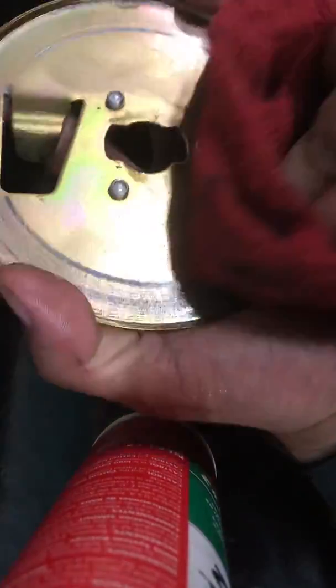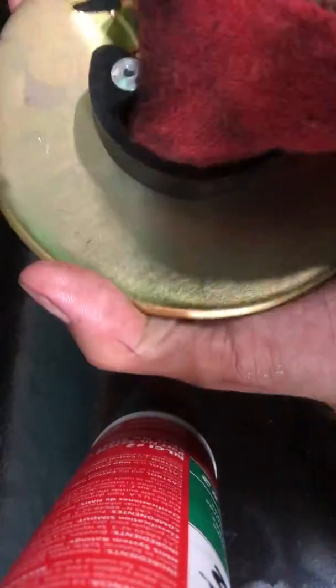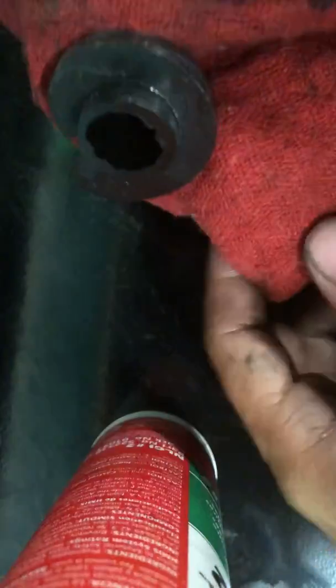So far, with all of these, I've been finding a little bit of oil in them, and I think it's just from over-oiling the pinion, and some of that oil's migrated down the shaft and into the clutch, because the shafts have also been fairly oily. You can see it real bad reflecting off of that worm gear. But just clean and dry, nothing special.